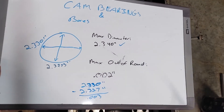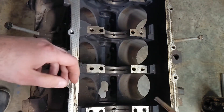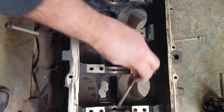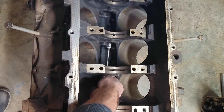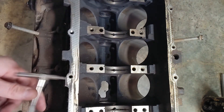That was the easy one to get to — the outer one. What you need to do is take your T-gauge and use it to access the rest of your bearings. You can come in here and get this one, and you can come in here and get this one. It is a little bit cumbersome to get in there, and that's why the telescopic gauge is probably more favorable than the inside micrometer.